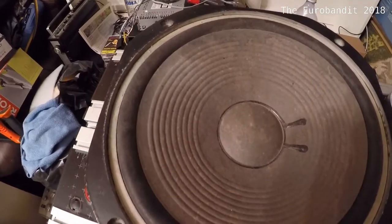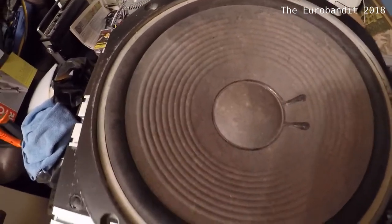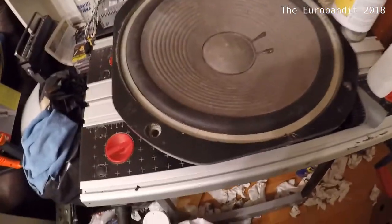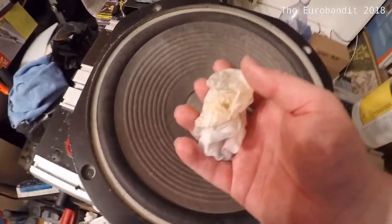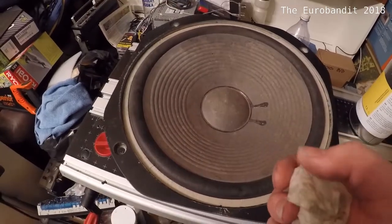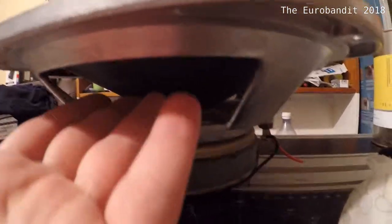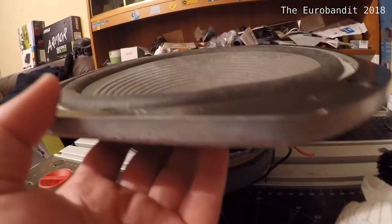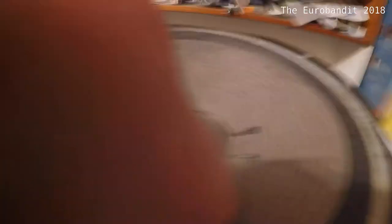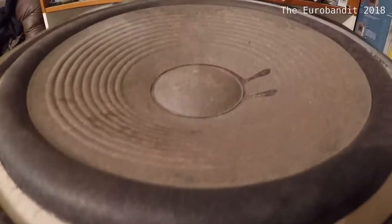You can use some window cleaner or whatever other cleaner that's not hard on anything for other materials. What you simply want to do is grab a paper towel and soak it in acetone — soak it properly, because if you don't, it won't pick up the stains. And while you do that, get your other hand underneath and hold against the paper cone, because you might want to apply a bit of pressure. Not too much, but basically keep rubbing while holding against the cone from the other side so it doesn't move too much.